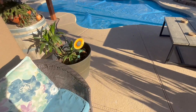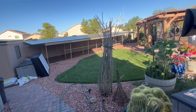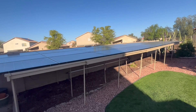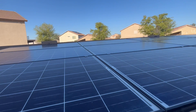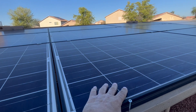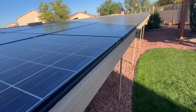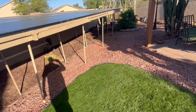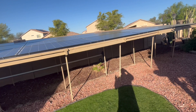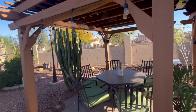Outside, we have the 24 solar panels, but only half of them are in sun and half are in shade right now. They are connected in 1,000-watt arrays: four 250-watt panels in series, then another four in series, those two sets paralleled together. We have six 1,000-watt arrays in parallel. We're also going to add a combiner box for better protection from lightning strikes. Here are the 10 new 400-watt bifacial panels that replaced the 16 old 250-watt panels.